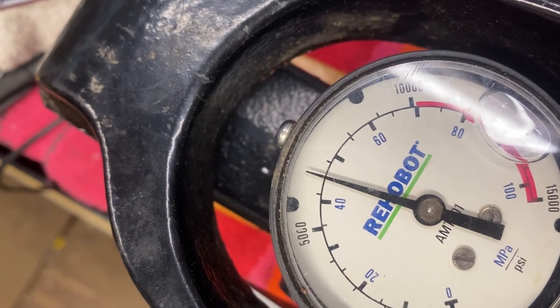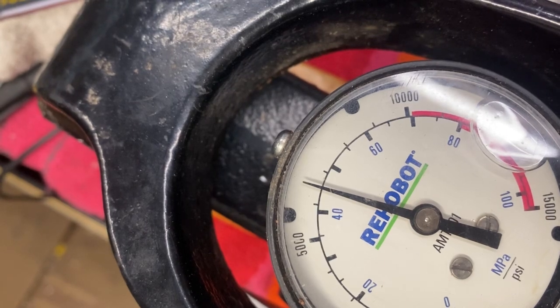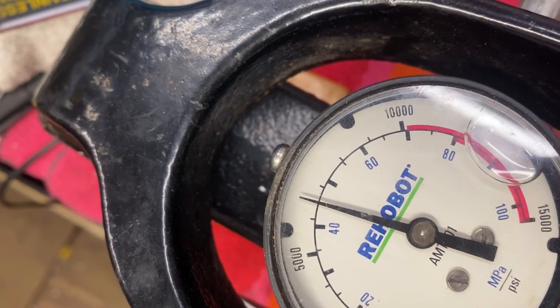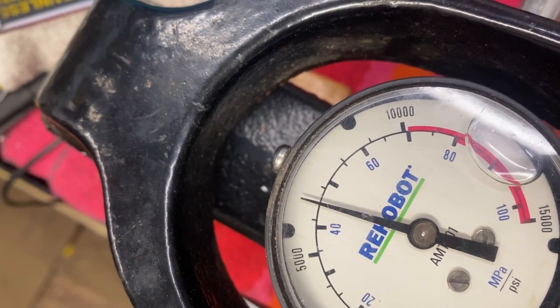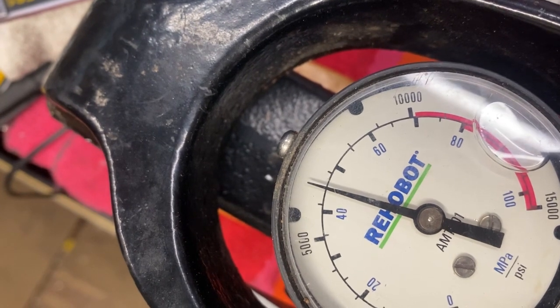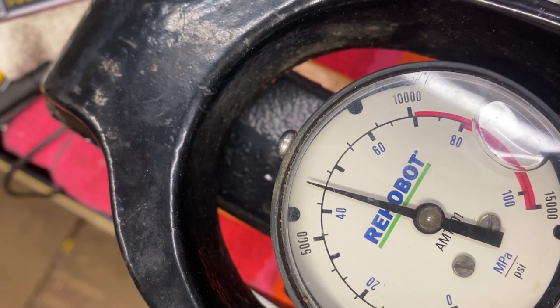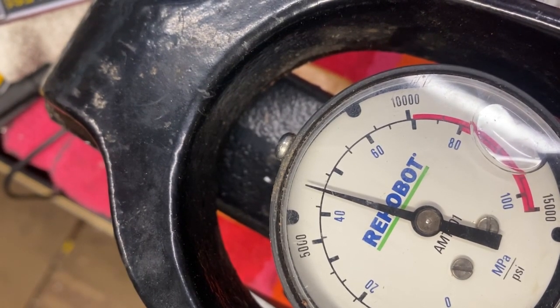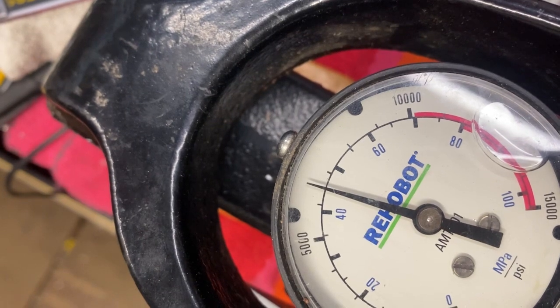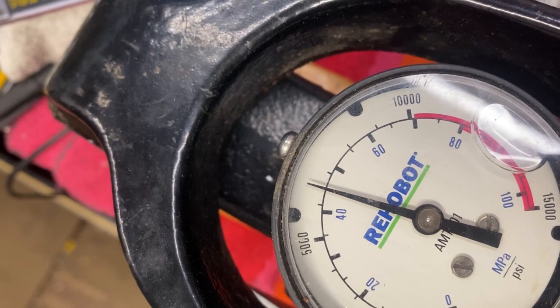Actually, the longer cylinder is usable because it got the conical bottom. It directs the stress away from the corner somewhat. It relieves enough stress from the corner that it's not an issue. It's a simple fix, a small design change for the cylinders, to make a radius corner there.